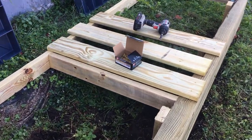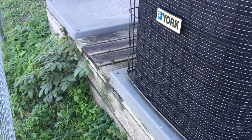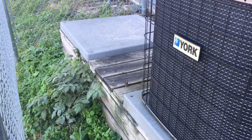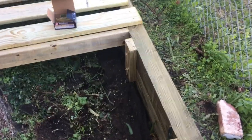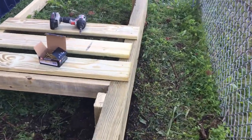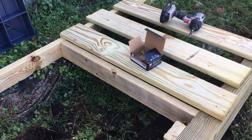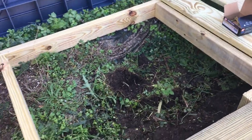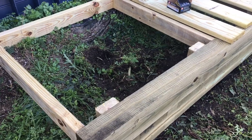I'm going to be filling the center in with deck boards, and you can see I've got my pads for the units — we're mimicking what we've got right here. I've got the deck boards in the center to fill up the space, and the two pads are screwed to the deck we're making. I've also put in a couple of bracing 2x4s on the back. After putting in my metal ones, I noticed the bottom ones still did a little bit of buckling, so those are forcing it straight — there are four of them there. Everything's square now, with 2x4s set in there as well. The dimension is 36 inches square, so when I set the pad on it, it'll be nice and flush along the edge all the way around.